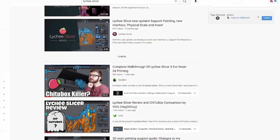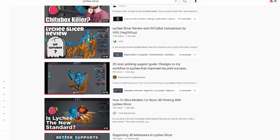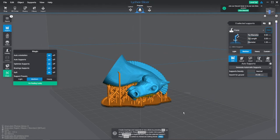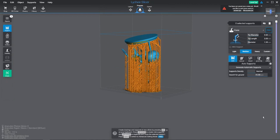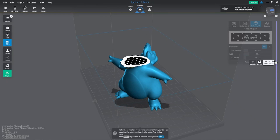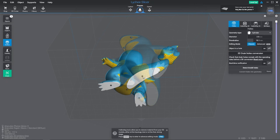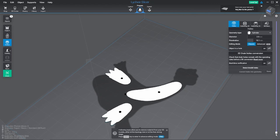There are many YouTube guides and I've linked to the ones most helpful to me in the description below. My favourite feature of Lychee is the magic button — this uses some very clever analysis of your model to suggest an orientation, support type and placement. Sometimes it suggests some pretty crazy ideas but most of the time it works well. The other thing to consider is that if you hollow out your model to save on resin you also need to add a hole or two. One function is to drain the resin out of your print when you're finished, but also if placed in the correct place they can help avoid suction which can actually pull your model from the build plate.